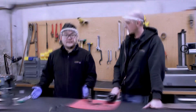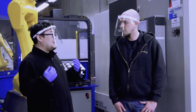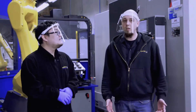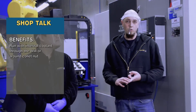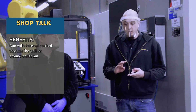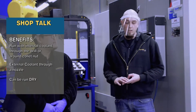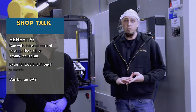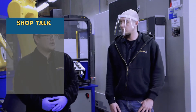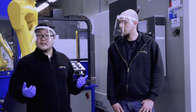Alright, well let's do a test cut to prove it. So we're back in front of the machine. Eric, can you tell me more about the benefits of ice tooling? An Ice Live Tool can either be run with internal coolant through a drill or around the collet nut, with external coolant through a nozzle, or it can even be run dry. Switching between internal coolant and external coolant is as easy as just plugging a passageway with a screw. So we're going to be doing a dry and a wet cut with the same tool — let's see how that turns out.